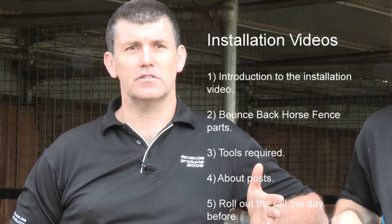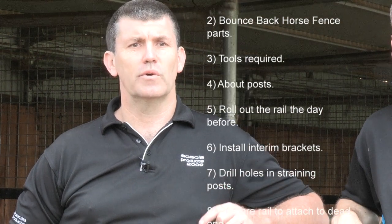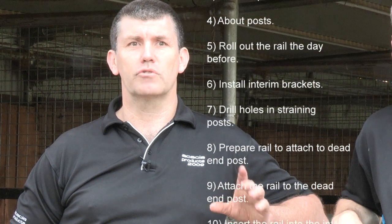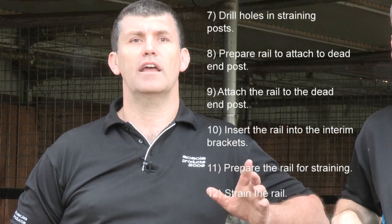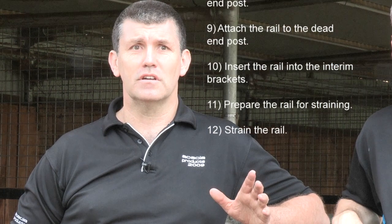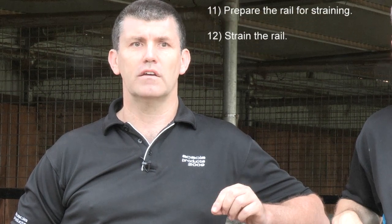We're going to talk about the posts. We're going to talk about rolling out the product the day before to make your installation easier. We're going to talk about the interim brackets. We're also going to show you how to drill the holes in the straining posts, and we're going to show you how to prepare the rail to attach to what we call the dead end post. We're going to attach the rail to the dead end post, and we're going to show you how to insert the interim brackets. We're going to prepare the rail for straining, and we're going to then strain the rail.